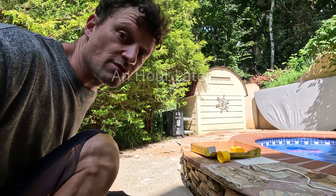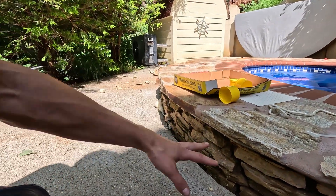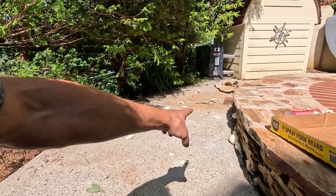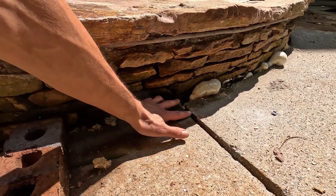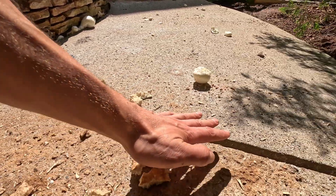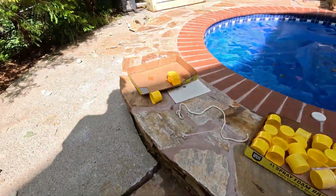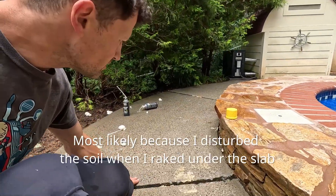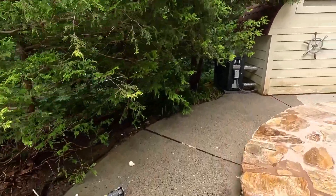Over about an hour after the GoPro stopped recording, this slab kept on rising — and interestingly, this end kept rising even though I didn't spray any foam there. It was rising from that corner going up, and this is actually pretty good. Even at the very extreme it's less than half an inch off. I'd rather it slope a little this way so water runs off on this side. It caught a huge break — last night it rained very heavily right after I finished, and the plate settled to almost perfect.